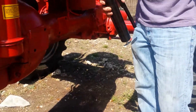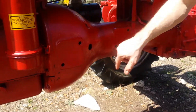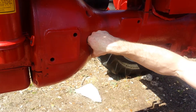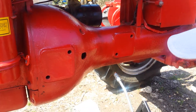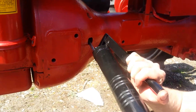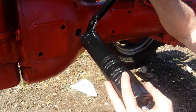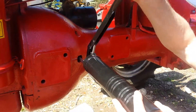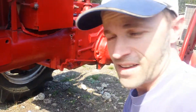And the last one is my favorite — this is the clutch release bearing. The grease point for the clutch release bearing is in this hole. It's dark and you can't see it, but if you have a long enough finger and you stick it straight in, you'll be able to feel the tip of it. Trust me, it's in there. This one requires not two strokes but ten full strokes with the grease gun. One, two, three, four, five, six, seven, eight, nine, ten. And with that, we've finished daily maintenance for using your handy grease gun on a Farmall tractor.